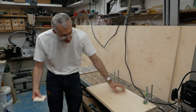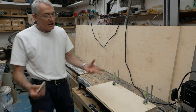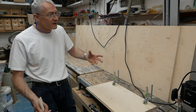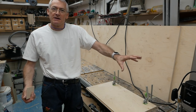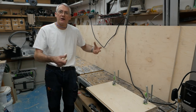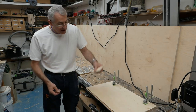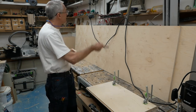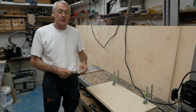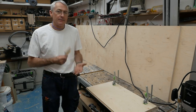Second test — that's all worked out pretty nicely. I made a couple of tweaks and it's a nice clean cut, as you'd expect from a router of that price with a good cutter in it. The adjustments are fine; it's a little bit stiff but obviously this is brand new. A couple of obvious points: I probably shouldn't be using a brand new tool untested on a job, fair point — and I should have moved those items down off the wall because you don't want them risking coming down on you when you're freehandling with a big router. I do the stupid things so you don't have to. But it all fits very nicely; I'll get on with cutting that rebate in the top and bottom and the sides. It does have to be stopped at the top and bottom of course, so that'll require a plunge and then a continue.